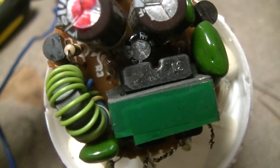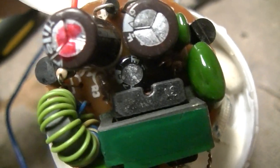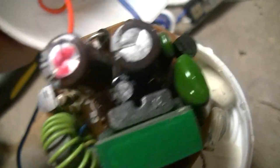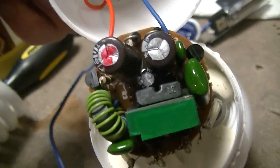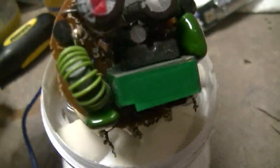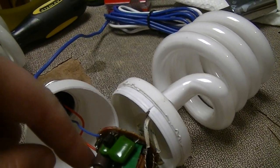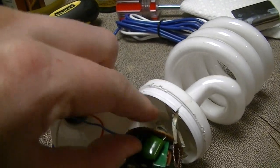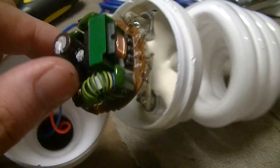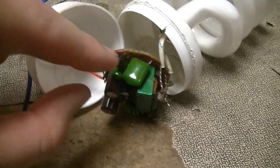There's another capacitor — I think it's a 50 volt electrolytic — and I'm not exactly sure what that's doing. There might be some kind of startup circuit to start the thing, and a base drive transformer for the two switch devices. Also, by the way, the caps on these boards can hold a charge for a long time after the things are disconnected, so I want to be careful poking around. I can't easily read the markings on those transistors, but they're going to be really crappy and cheap — they're in TO-92 packages, so kind of dubious.